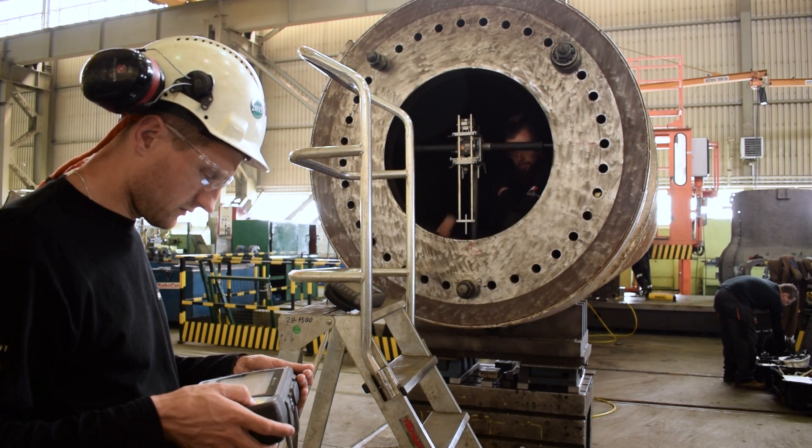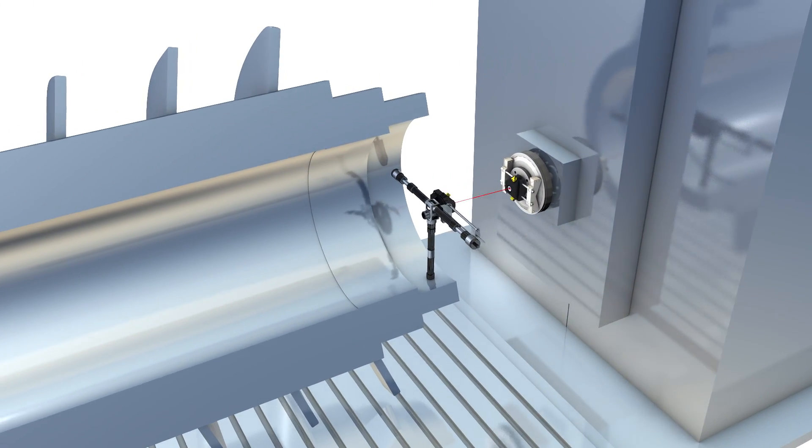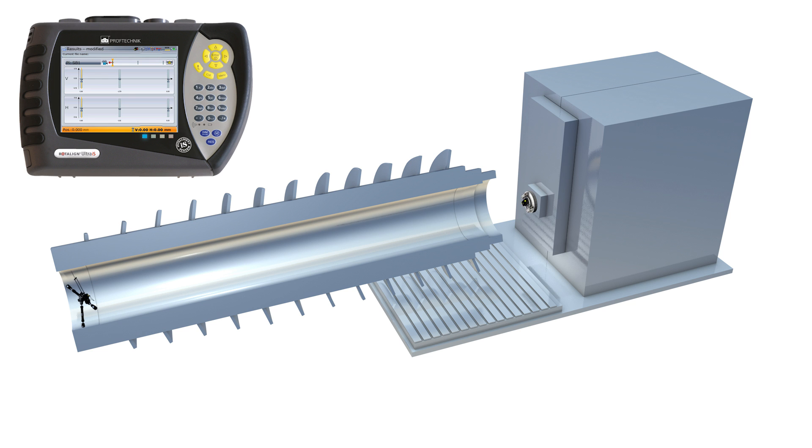Let's watch. With the laser placed on the spindle and the sensor placed inside the impeller, the engineer is using a rotation laser setup to adjust the boring bar in the exact same axis as the helixes. The laser is attached onto the boring bar and the measurement sensor is operating on the base bores.